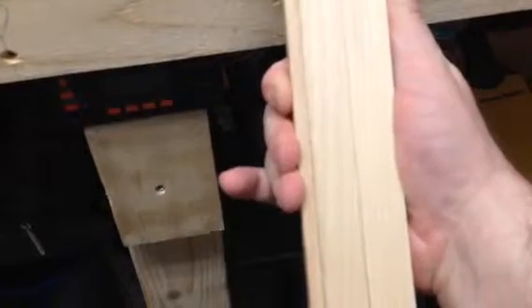To give a better example — I'll take two pieces on one side, then I'm going to have this quarter-inch oak in the middle, and then two more pieces on the other side. That'll make the build-up of my neck. They say if you can squeeze with your hand and there's no gap in between, that means it's good for glue-up. These pieces came out pretty flat, so I may not have a lot to do when I get to that stage.